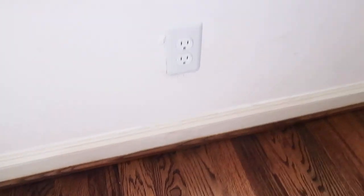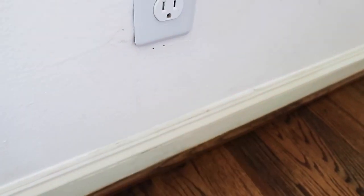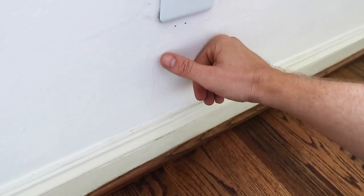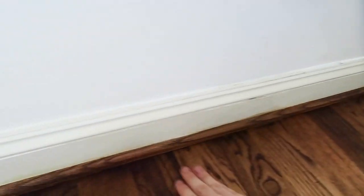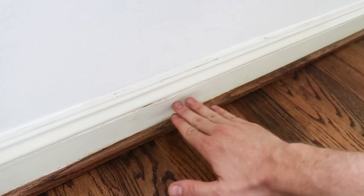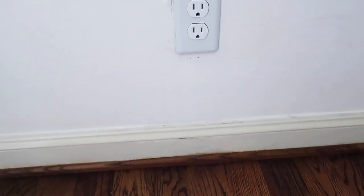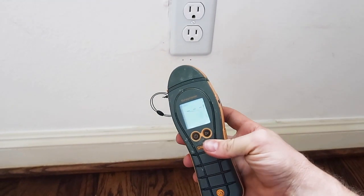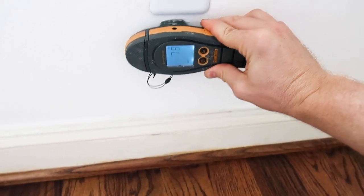Looking at the wall with the naked eye, you can see they were doing some repairs — fresh paint, and you can see where someone has probed the wall in the past because there's some moisture. You can almost see faint water lines coming out of this receptacle. The baseboard is a little warped right here, and right underneath the window we have some issues. Let's do the non-intrusive test first — you can see the back of the moisture meter working, and then we'll test right underneath the outlet.